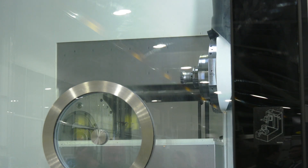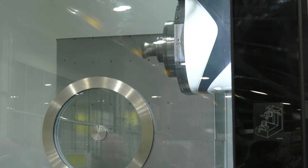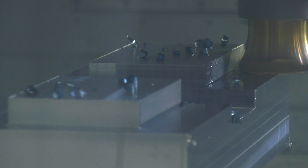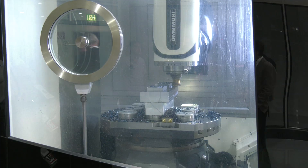Let's dig into a bit of the cutting data. What sort of speeds and feeds are some of these tools operating at? If we're talking in respect of the high feed milling cutter, for machining this hardened steel that we're using at present, it's around 200 meters a minute and a feed of 0.8 per tooth, which is fairly high.